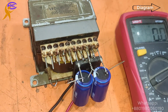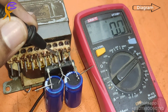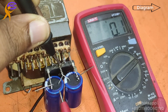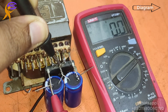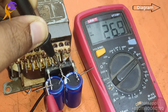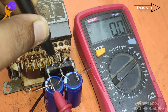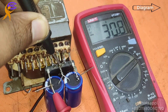Now I am going to check the voltage — the ground voltage. The positive is 35V. Positive 35V and negative 30V. Look — this capacitor is disconnected. So this one is 35V and this one is 30V — that means the capacitor is disconnected and not working. Sometimes it is making short, then disconnecting — for this case the voltage is having problems. 30 voltage.